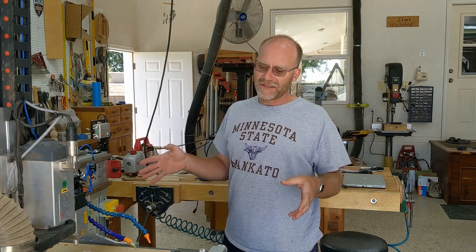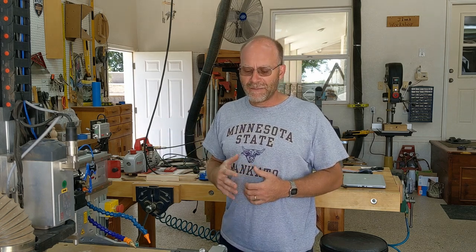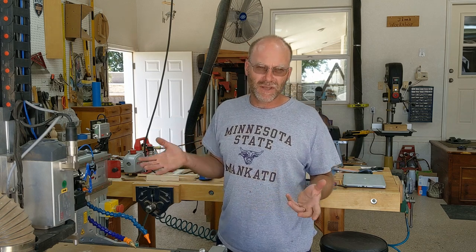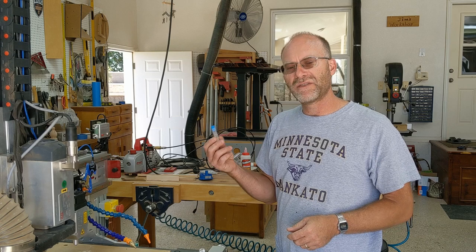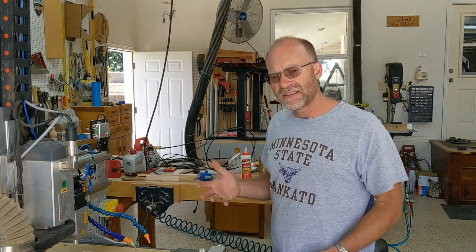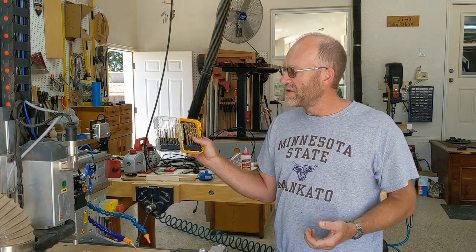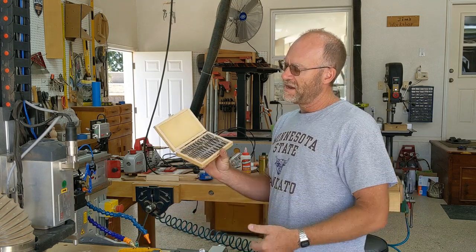One of the really cool things about a larger CNC like this is it's really good for making things like fast track or cribbage games where you need to drill maybe hundreds of holes in a specific pattern to make games to put pegs in. You only need one drill bit size, so you can go order a custom bit — it can be an end mill or a drilling bit. But in some cases you want to drill pretty much any size from your regular twist bits or maybe some of your woodworking brad point bits.